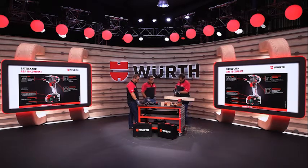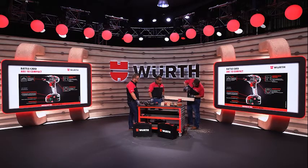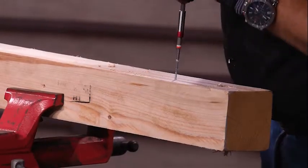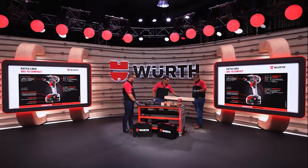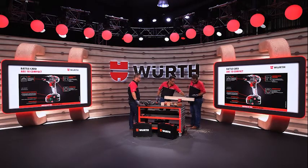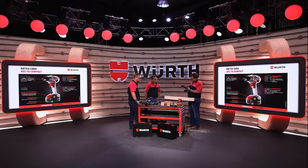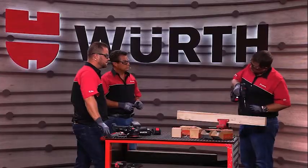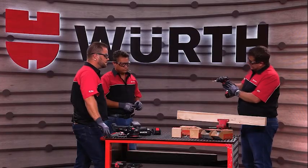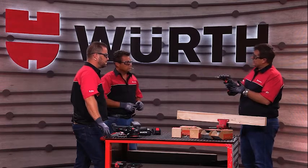Which is absolutely brilliant. Let's take it back two notches and see what it does. So the same screw, just two notches back on the gearbox. Okay, we've got a nice flush screw in the surface over there. Absolutely brilliant. And what's nice with this, I don't know if you've realized, is the trigger itself. It's a variable speed, so I can control it going into the piece of wood and then speed it up as I need it.